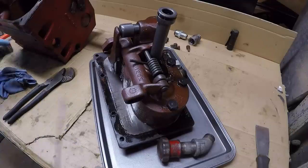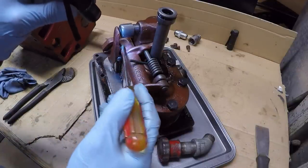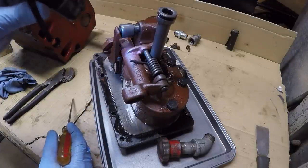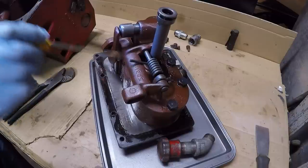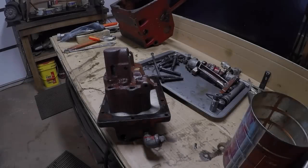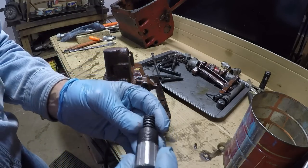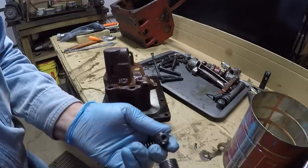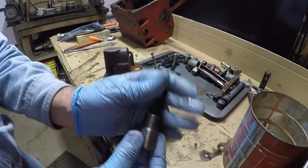A lot of times what these do is this gets rounded off in here. This is pretty much identical to the belly pump system too. You have to re-square that up, make sure all the rounded corners are fixed to get that working again and you can get these back into service. So anyway, we get this torn apart. First thing we got to do — there's a bunch of pins over here to take out. Get all this top stuff out of here and then start taking the bolts out. I've got all the accessories off the top. Got the relief valve out. You got to be careful when you take this apart — there's a spring in there, a sleeve, and a check ball. Just make sure you know which way they go back together. Don't lose any of those pieces — very important.